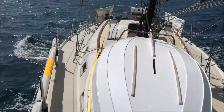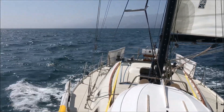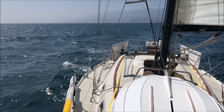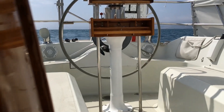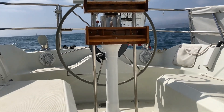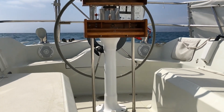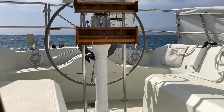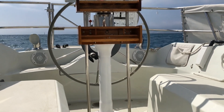On most casual cruising boats out for a sail on a Sunday afternoon, very little attention is given to sail trim. And if a wheel pilot suddenly seems erratic — if the boat's slewing around this way and that — it's usually just a matter of letting the sails out until they luff and pulling them in a little bit more. Once the boat's balanced, it's easy for the wheel pilot. There shouldn't be any muss nor fuss — just a little quiet clicking in the cockpit on any point of sail.